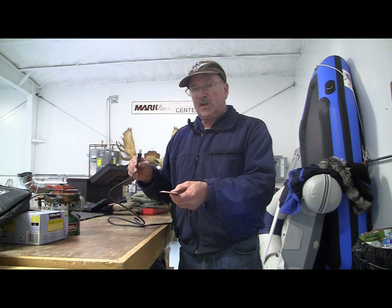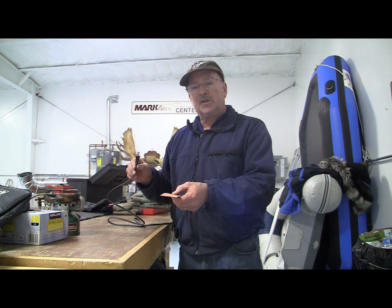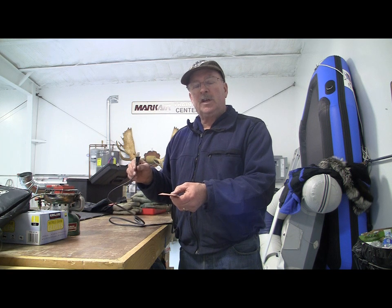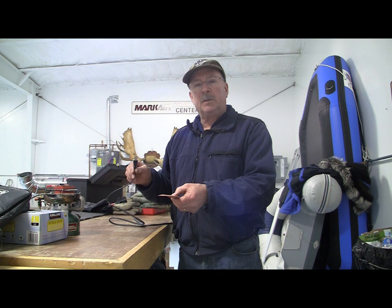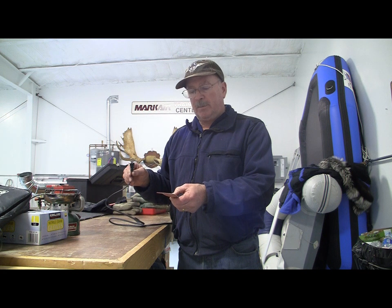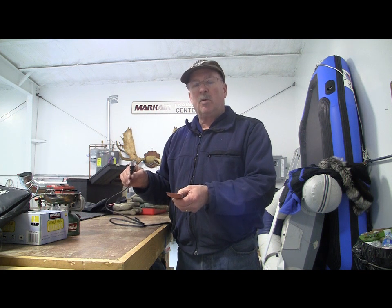If you're using only a silicone pad on your engine, if you're preheating a cold soaked engine, you're going to need to leave that 200 or 300 watts plugged in all night to be able to preheat that engine sufficiently to start without possibly causing damage. So this would be the very minimum you want on your airplane.